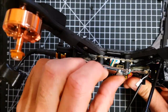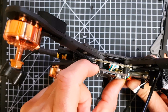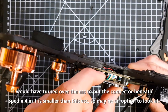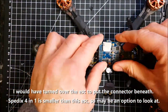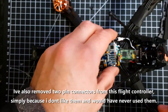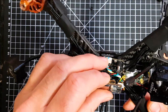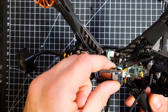When I put the flight controller on top I've also got acres of space inside, and that's the downside of using a flight controller without built-in grommets — I've ended up wasting so much space. If I'd used a CL Racing F4S, the Raceflight one Richard used, or Joshua Bardwell's F4 with built-in grommets, I could have sat the FC much lower. But the reason I didn't go that route is that I'd have lost this rather simple pin connector way of connecting the two boards together.